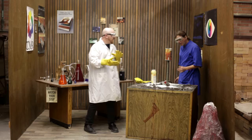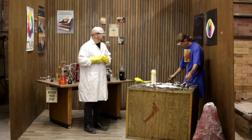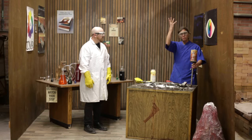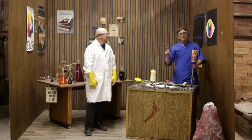The mechanism behind the volcano is compressed air. We have a compressed air valve plumbed up to an electronic solenoid, which is electrically controlled by a foot pedal. As soon as the non-dairy creamer becomes airborne and mixes with air, it becomes highly combustible, and that's when the sparkler we used as a pilot light ignited it and made the flaming volcano effect.